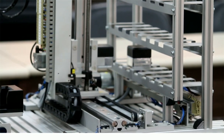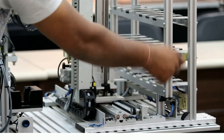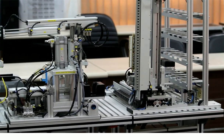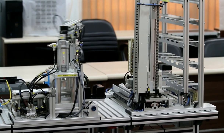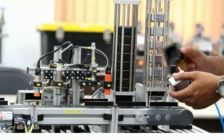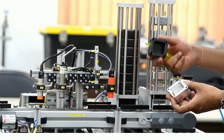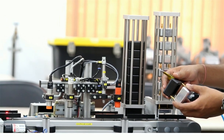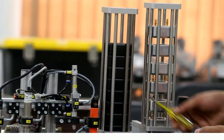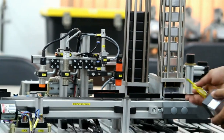You can see the AS/RS unit keeping the material in different particular locations. When the lower side rack is filled, it will move upward and keep the material step by step. In this mechatronic system we have two types of objects — non-metal and metal. We want to assemble both cubes automatically. We have two storage units: the first is for metal objects and the second is for plastic objects. Then there is the conveyor belt over which the cubes run.